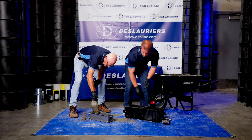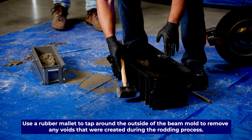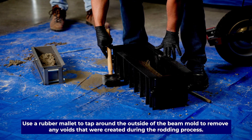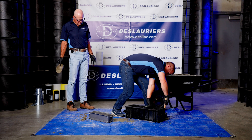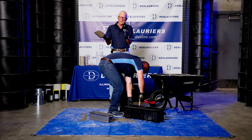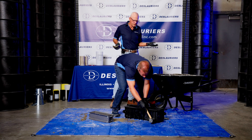When he's done rodding, he needs to knock the voids created by the rod out of the specimen. He's going to use this rubber mallet — firm taps right on the ribs. Watch for those voids to come out, then do the other side. When the rod penetrates the concrete it creates a small void, and you need to close that up so that when you test this in flexure there aren't any weak spots in the concrete sample.